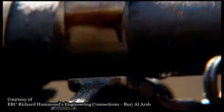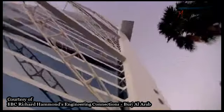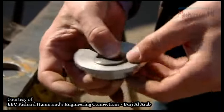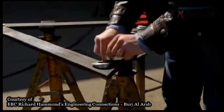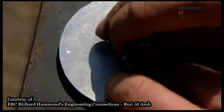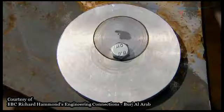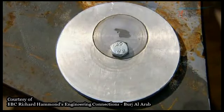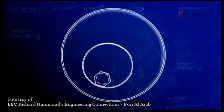The builders of the Burj Al Arab borrowed from that idea to overcome the problems caused by extreme desert heat. This fixing is called an eccentric fixing, designed using the same sort of principle — it's like a cam inside this hole here. And that gives us the flexibility we need to cope with this heat expansion. So let's put it in, line it up roughly in the big hole there. If I drop that in, we can manoeuvre it around — and there it is, that lines up perfectly. The eccentric fixing allows the top hole to be moved so that no matter how much the steel expands, it can still be aligned to the bottom hole.